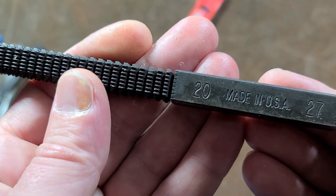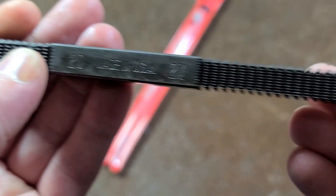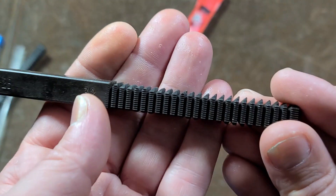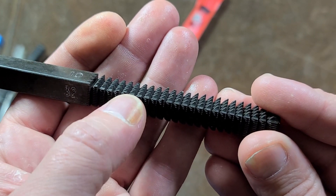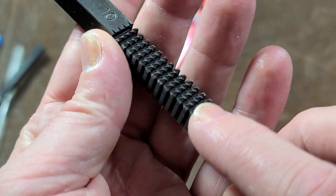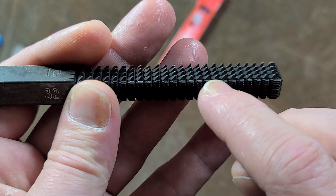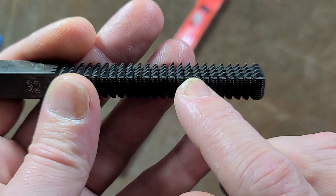I was noticing some things — it isn't made as well as the NuThread. There's a little broken corner right there, which isn't so bad, but looking more closely you can see right here it's particularly bad. We can see a bunch of the corners are broken off. This is actually a result of not very good quality control during manufacturing. How we know that is if we look closely, you can see how it's all blackened on the broken corners.